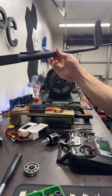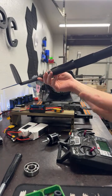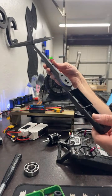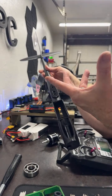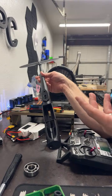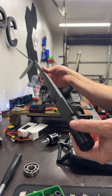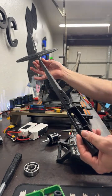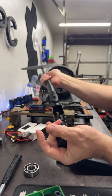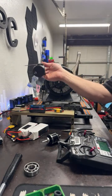But it's rigid enough in flight to where I believe it's going to be very effective. It's a little bit heavier than the original plane was intended, because they were printing it with, I think, an expanding foam, sort of like a PLA Aero or a LW PLA, like you would see from 3D Lab Print planes, things like that. And I had to make some modifications. This is solid infill, not the tube itself, but the walls are solid infill for the TPU. So it's not much heavier, but it's still rigid enough to where it can handle flight.